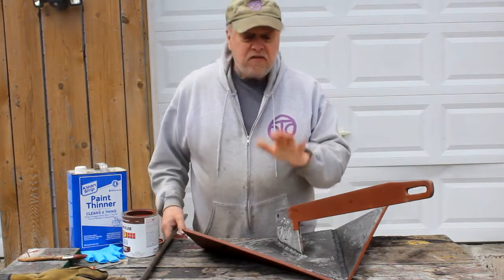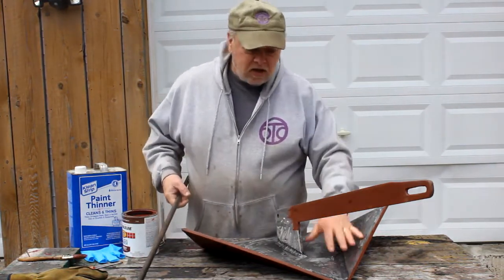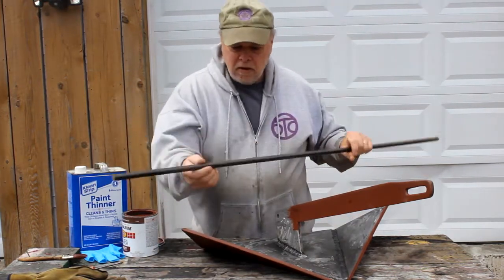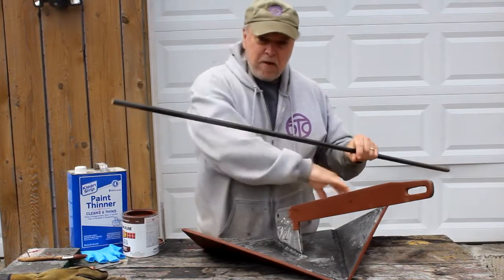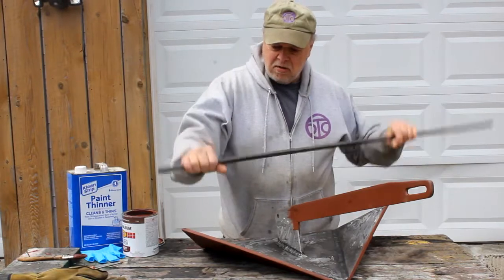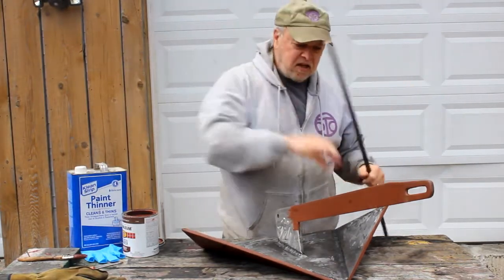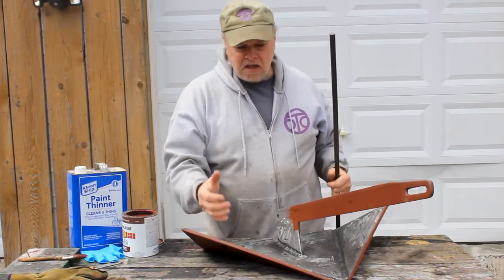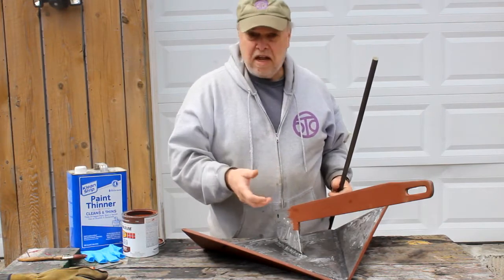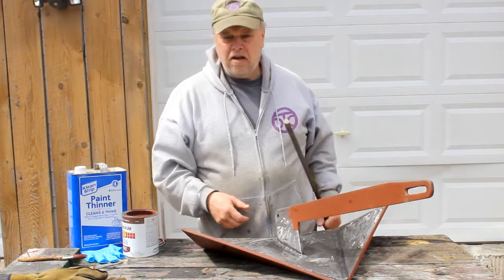The only thing left to do for this to be completed, because the welding on the anchor itself is done, is take this 5/8 inch round bar and bend it into a half moon shape, a half circle. It's going to bend around like this. That's going to give me my rollover bar. So if the anchor lands somehow upside down, it'll roll over when you're setting the anchor and then get a bite, dig in. That's what these are intended for.